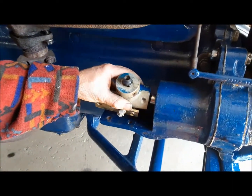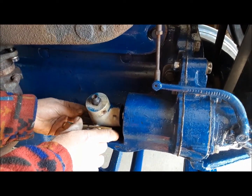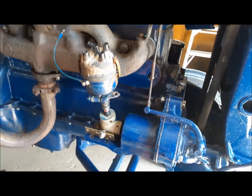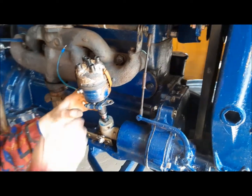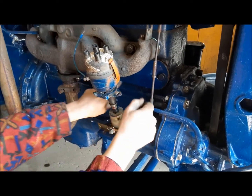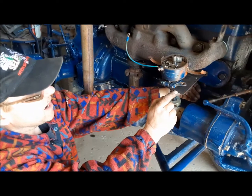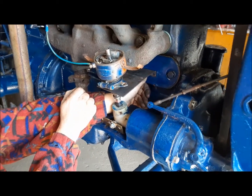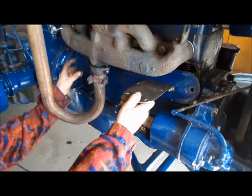We'll get that engaged — we've got room here to drop a bolt through there. So here's our first mock-up. We've got the distributor mounted to the gearbox, and I've got clearance to the exhaust manifold so the distributor's not going to get cooked. Now I just need to make my brackets back to the timing cover to hold it. We've got our upper bracket made, and I'll remove the valve cover — I've marked it already — and we'll bolt this to there.